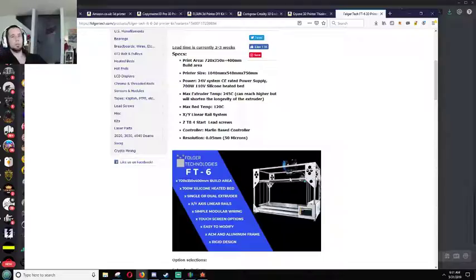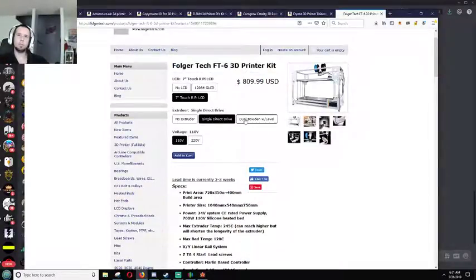What I would recommend is you'll end up buying these and then swapping the dual setup out for a different dual setup, or just go with the single one and then go to a dual. I don't know. If you want dual, buy the dual one, experience that Bowden tube, and then there are all the upgrades on Thingiverse you can print out to get a direct drive.